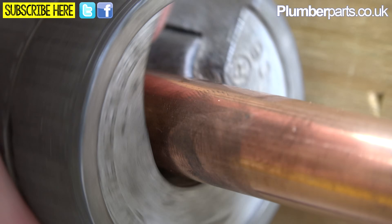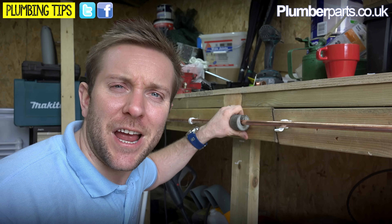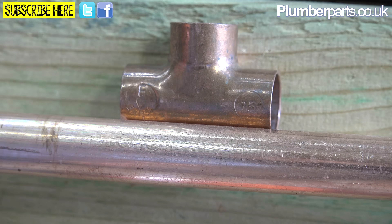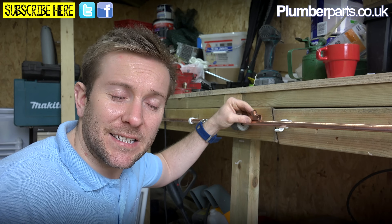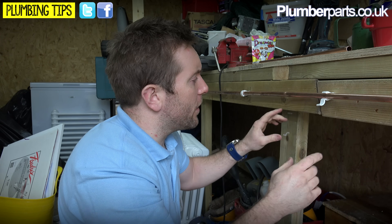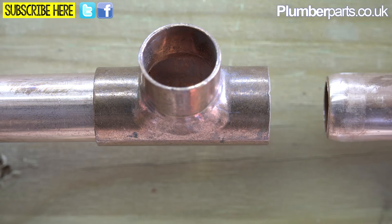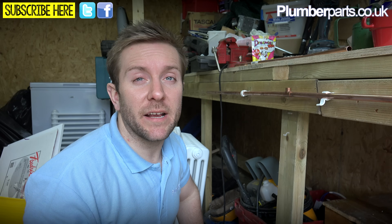Get your cutter under here like that, and use the arrow on your cutter to know which way to rotate it. As you're probably aware, subscribers, this is a very simple video but let's watch it for the ride. Basically, I always go with the little finger width. If you really want to do it properly, you can get yourself a pencil, pop the tee on the pipe, use the sides of the shoulders of the tee, and mark a pencil line there and there. This is if you don't have any flex. If you've got flex you can just cut it, pull the pipe apart, slide your fitting in - say a solder fitting - push it in like so, and that'll be ready for soldering up.